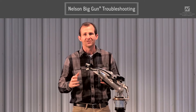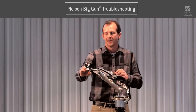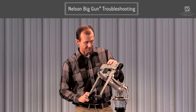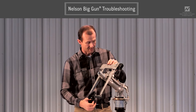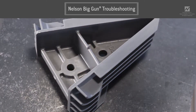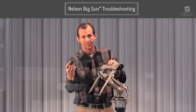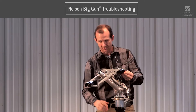If nozzle pressure is low, you don't necessarily need a new pump. The first solution is this drive spoon or drive vane — the black one is the standard drive vane on the SR100 and for larger nozzles on the SR75. If you're in a low pressure situation, say below 40 psi and having sluggish driving, you can use the gray drive spoon, our low pressure drive spoon, part number 10612. It's very easy to replace using two 7/16 box wrenches, and it gives you a lot more drive and kicks the arm out of the stream much further.